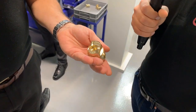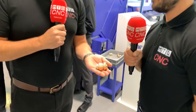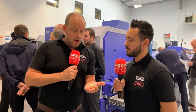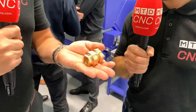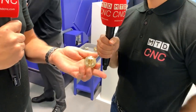Irregular machining. And the idea behind this sort of part is that normally you'd look at a part like that and you would go, right, how am I going to machine this with the axes I've got, with the tools I've got? Now you look at the part and you think, right, to get that down to the minimal cycle time, I'm going to do it like this. In fact, I'm going to use the back spindle, I'm going to use the front spindle, I use the B-axis on the front or the B-axis on the back. You can actually optimize incredibly powerful machine to get these off as fast as possible.